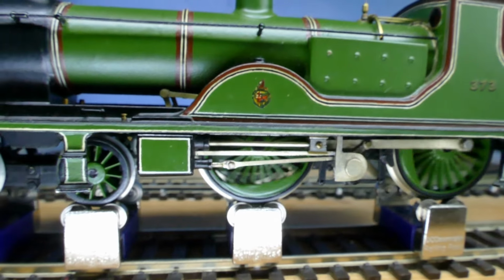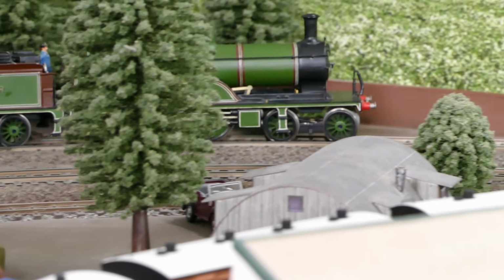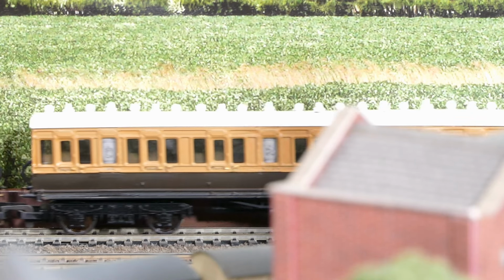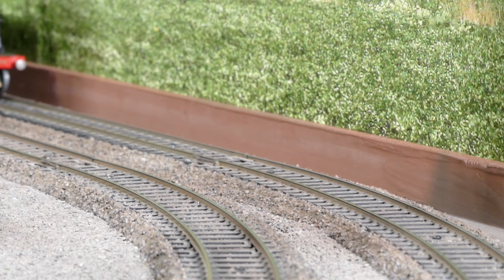The driving wheels were 6 foot 7 inches. Among the other notable innovations, all 4 valves used steam-assisted reversing gear, so the driver could set all 4 using a single lever in the cab. They were not short of power either, with 22,313 pounds tractive effort available.